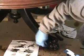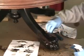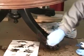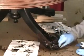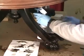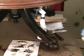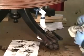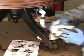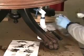Final cleaning with a Scotch-Brite pad. That's where the cleaning is really going to be crucial here, because the cleaner that you get this with a Scotch-Brite pad, the less sanding you'll be doing later. You would spend days sanding four legs with that type of design on a table like this. And as you're going to see, by using this type of stripper and this type of application and removal, you've saved yourself a lot of hours of sanding. That there is ready for a finish without sanding.